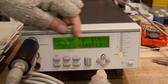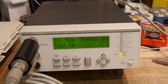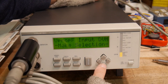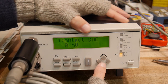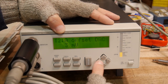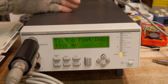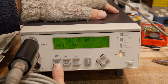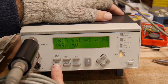You could actually turn sensor A into a DVM — it tells you how many millivolts the sensor is actually measuring and what range it's on. There's a BNC in the back you could use as a DVM for testing. There are hardware tests, loop back tests, offset tests, gain tests — lots of things. I brought a lot of test voltages over to the A/D so I could troubleshoot what was wrong. There are a bunch of built-in things in the test menu.